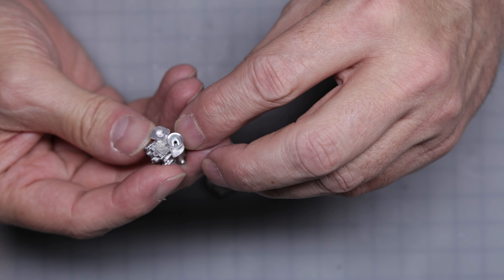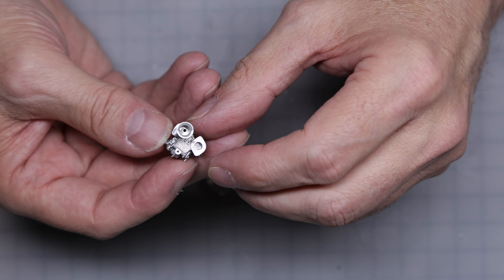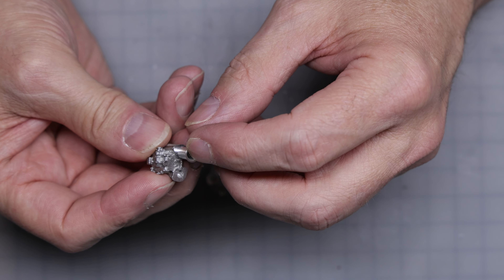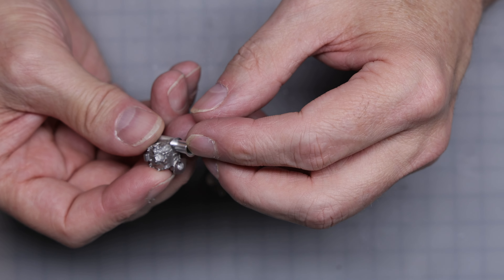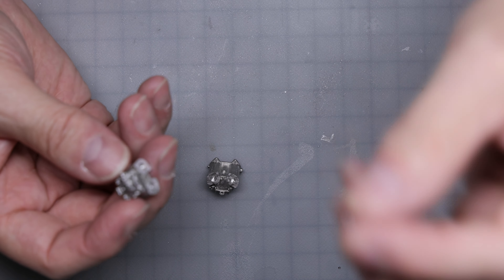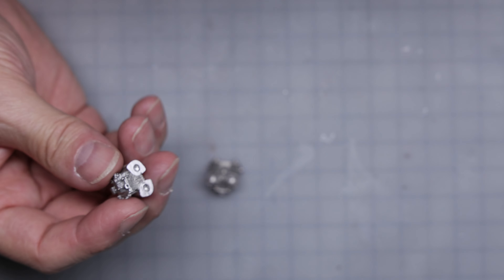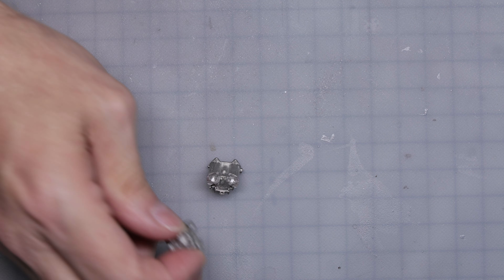My next task is to figure out how I'm going to match these two surfaces so they look good. I'm thinking a semi-polished surface is what I'll leave — that will mimic the aluminum fairly closely. What I'll probably do is paint it all, then remove the paint from that surface and glue these on. I've got some Top Studio bolts I can put in there for the fasteners. I've just started to file this one — you can see I've gone a couple passes over it and it's touching here but not here yet, which shows how concave it is.